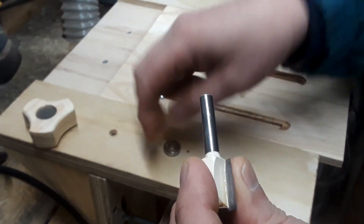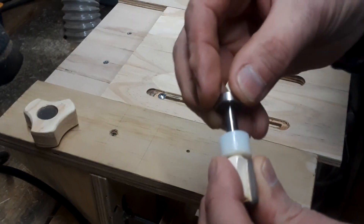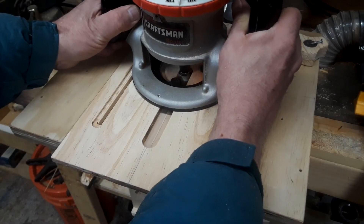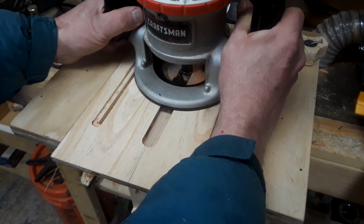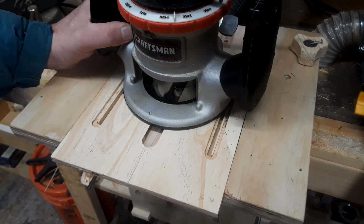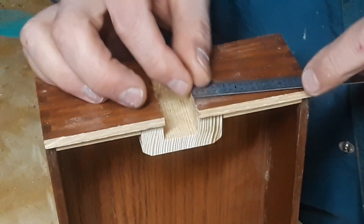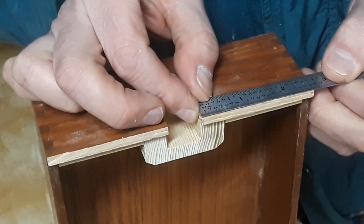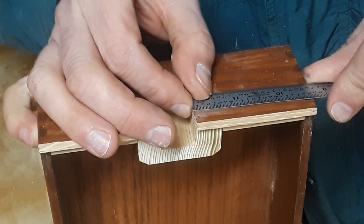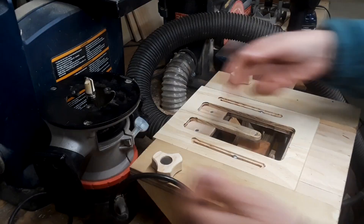Of course the problems were not all solved yet. The box doesn't fit through the jig top board, so I'll have to find a way to center the template. But for now we're moving forward. Because the box now sits 3/8 of an inch lower, my router bit bearing needs a spacer to lift the bearing up by 3/8 of an inch. That also means my router chuck can only grip 1/2 inch of the bit. StewMac has a bit that is another half inch longer, but that will have to wait. I don't want a router bit flying around the shop, so the chuck will be extra tight and I'll cut very slow. The mortise came out a 1/16 inch off-center, so I would have to move it up a 32nd of an inch — but I may just leave it, although centering on the box will have to be fixed.